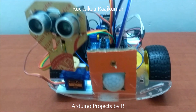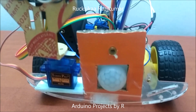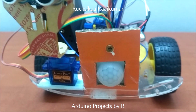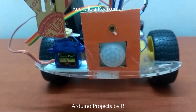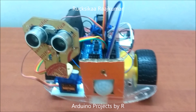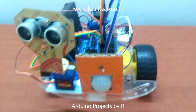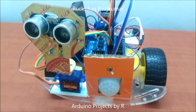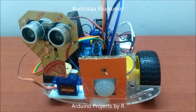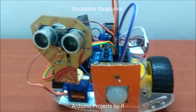In this prototype I have used a laser diode instead of the UVC LED. I've also used a PIR sensor so that the robot will stop once it detects human motion. This is essential because UVC rays are harmful for humans, so it's highly recommended that humans are not present when this system is activated.